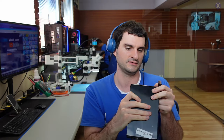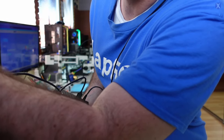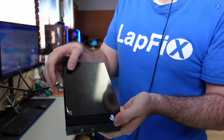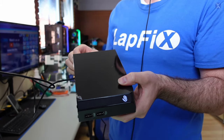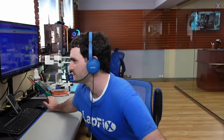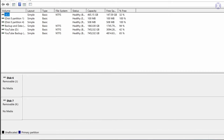We got the power on, but nothing came on. Unless there's a button here to press — sometimes there is, sometimes there isn't — and it looks like it might be dead because it's not coming on at all. Usually when you plug it in, you should get some type of power. So the light came on when I put in the USB. That Seagate light wasn't on before. Let's see if it recognizes it and if we can access it. Let's bring up disk management because we should see something.